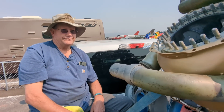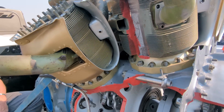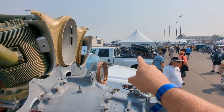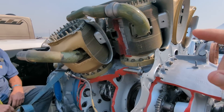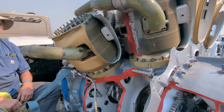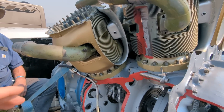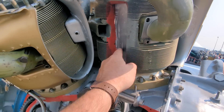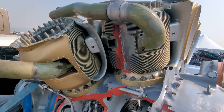A Bristol freighter. The Bristol Centaurus sleeve-valved engine, found commonly in the Sea Fury aircraft, though this one was for a transport aircraft — a Bristol freighter. It's some incredible technology. Most advanced reciprocating radial engines, like that 4360 right over there in cutaway view — that's also Brian's — use traditional poppet valves. But in an effort to improve scavenging and overall efficiency, the British came up with this crazy sleeve-valve design with a rotating sleeve inside the cylinder that opens and closes the intake and exhaust valves.